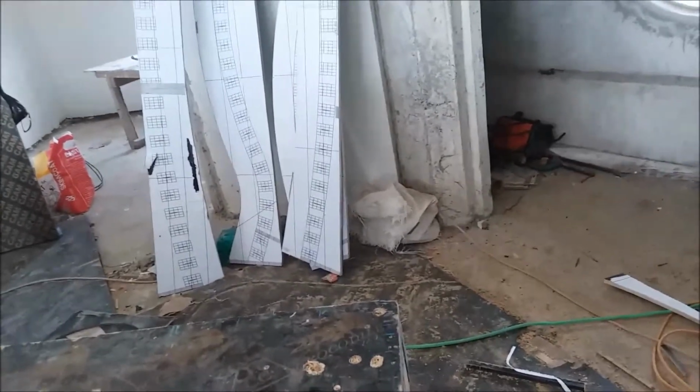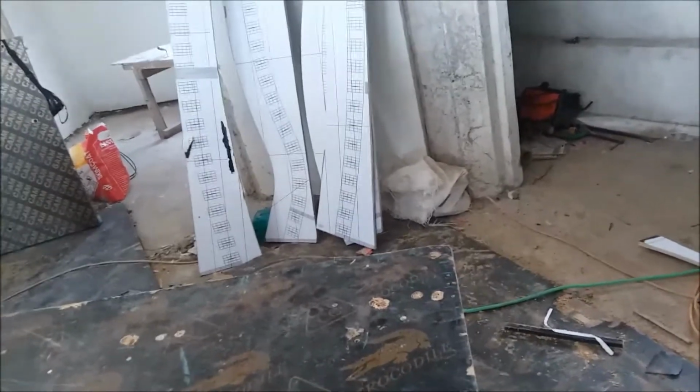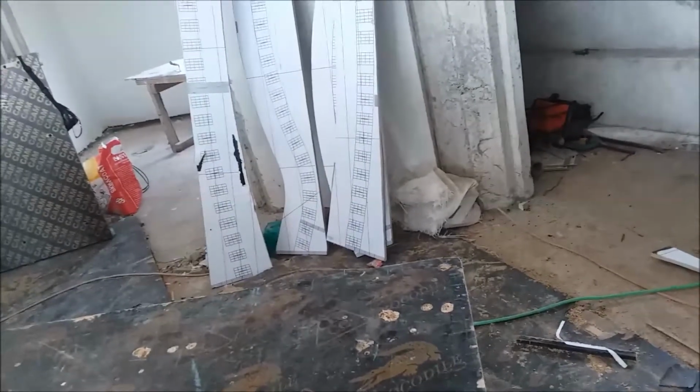I just draw a square that big, and then a rectangle. And as long as you want, I can. I've done them 150 inches long, better than 12 feet, because that's how long the parts were. If you can nest all your parts to use up all the area of the paper, there's no reason not to make it longer because it's easier on them, it's easier on us, less wasted material when you go to cut it out.